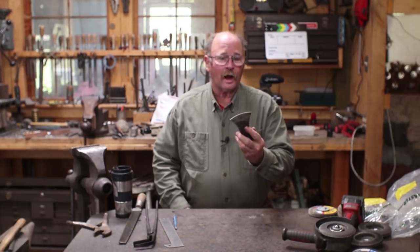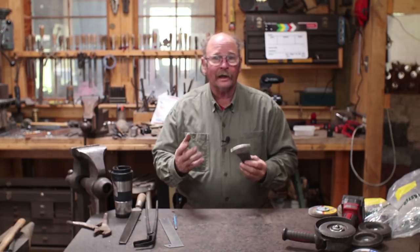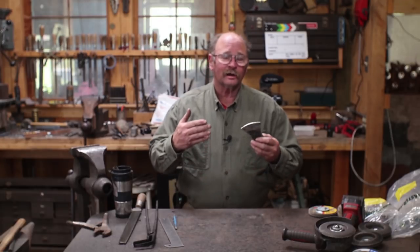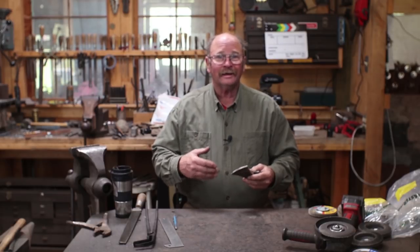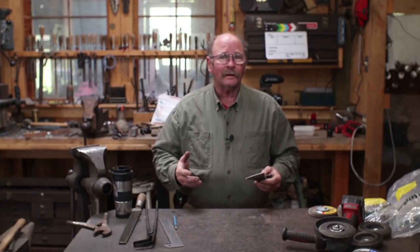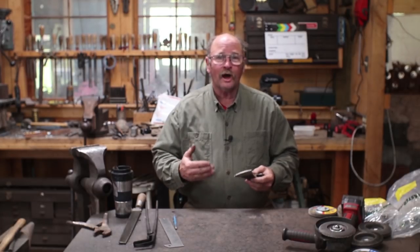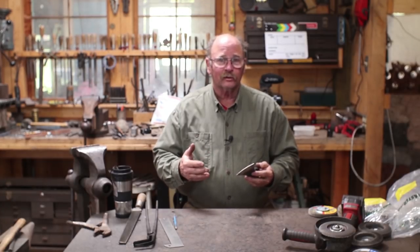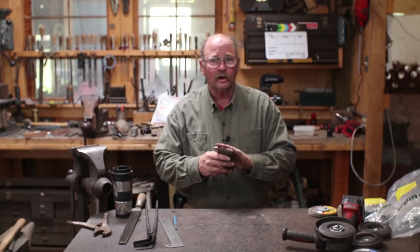Now unfortunately, this is not one that shows up in the Heat Treater's Guide companion app that I have on my phone. It's a great app for hardening and tempering and looking up specific hardening temperatures. But since we're not going to be able to set a specific temperature anyways, and it's a simple carbon steel, we'll use the theory that it's a little higher than non-magnetic, which works pretty well for carbon steels. I don't like that method for steels with other alloys because those other alloys change the critical temperature, but non-magnetic still occurs at about the same range. Somewhere around 1400 to 1500 degrees is where it becomes non-magnetic, and that's a pretty good hardening temperature for most of the simple carbon steels.